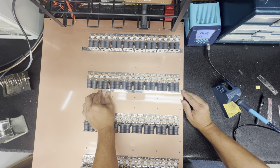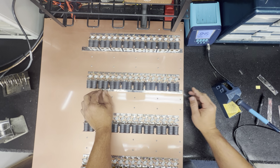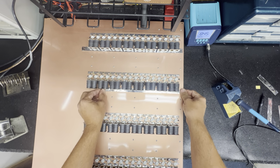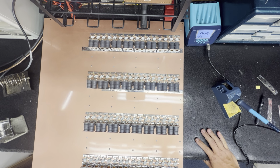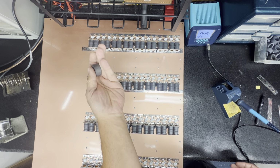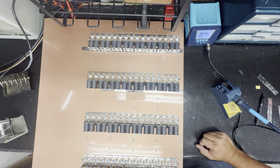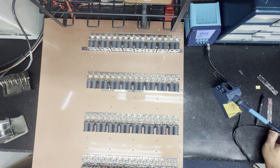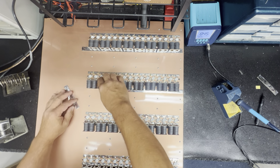Now what I'll do is put ferrite on every one of the wires feeding the transformers. Like every one of the hot wires, there'll be one right here, probably a 4-gauge on each 16 pill. There'll probably be one right here and one right here. I'll probably put these ferrites right here on the 4-gauge and wrap it up. These big boys, just to make sure AC doesn't get on DC or vice versa, or RF gets over there on the DC. But that's why I do it this way. People want to know, now you know.